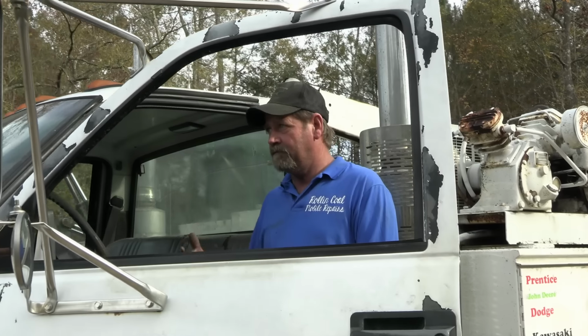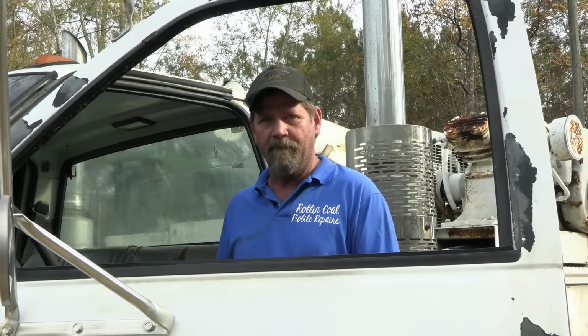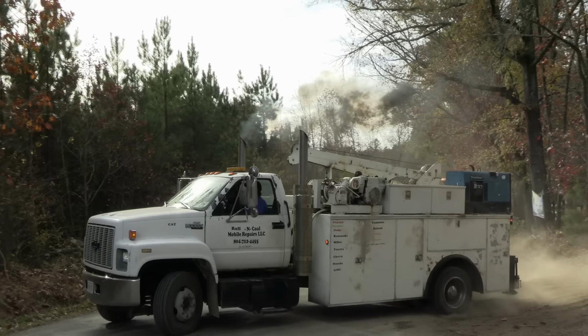All right, so we came out this evening, the John Deere skidder, the top pin where it pivots on the arch, the pin came out, lost the pin. Called in and got a pin, went and got the pin and got the wrong pin. The pin's too big. Got the right pin, come back. Finally, we're moving over the boom enough to get the pin back in and got the bolt back in and everything is good. While we did it, we checked all the bolts to make sure none of the other pins would come out. So hopefully it will keep running.